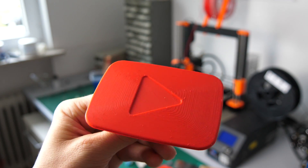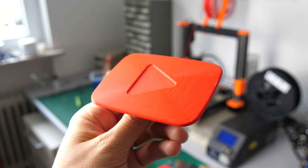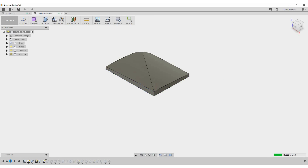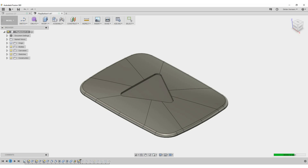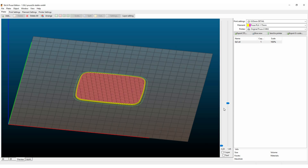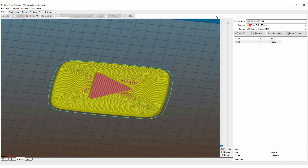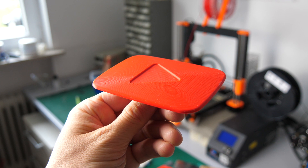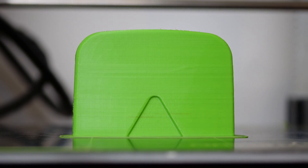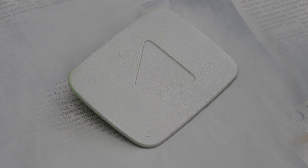In order to make my play button reward I had to do three things: design and print a play button, copper plate it, figure out a way to dual color print on a piece of cardboard, and then build a simple frame to hold everything. Since I already designed a play button for my 1,000 subscriber special where I CNC'd it from wood, I used the existing model and printed it in regular PLA on my Prusa. I used a layer height of only 0.05mm to reduce the staircase effect as much as possible. The print takes longer that way but it saves a lot of time during sanding. I printed it on its back, which is not ideal for a smooth top layer, and considered printing it in two halves but that would have required a ton of sanding. After the print was finished I sprayed the part a couple of times with filler and then wet sanded it until I was happy with the result.